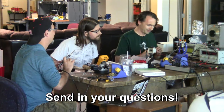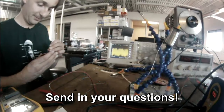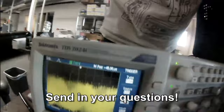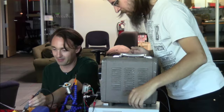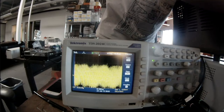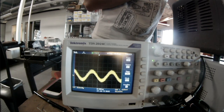It's really low, it's 20 millivolts per division. Let's take a picture of it. This is actually kind of interesting. In the old days, they actually put cameras up against the scopes, and that's how they recorded them. In the old building, we actually had one of those cameras. It was a Polaroid Land camera with a crazy attachment that nested right on the front of the scope. So this has got about 20 feet of wire, as well as being the 5 millivolts target signal. If you take off the 20 feet of wire, I don't think we can get much cleaner than that.